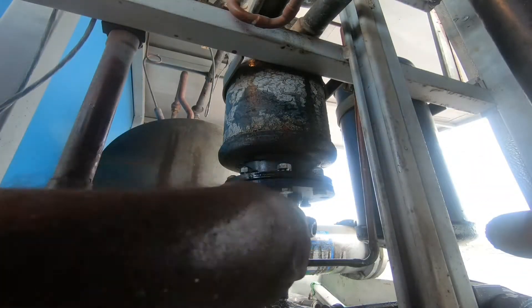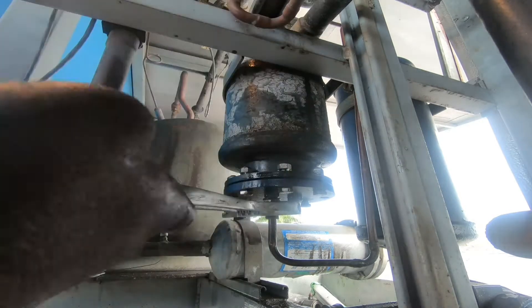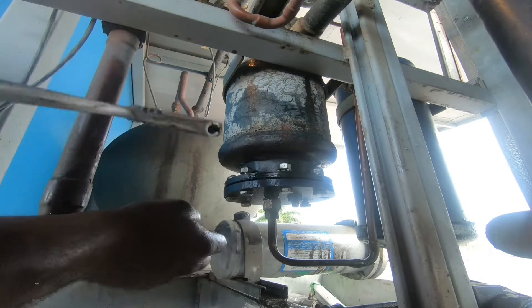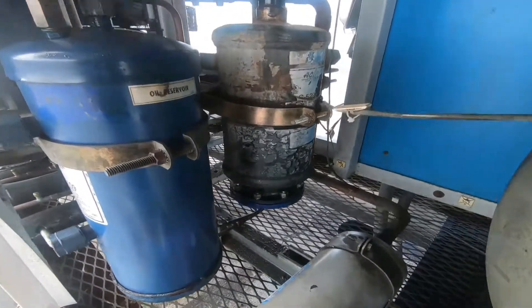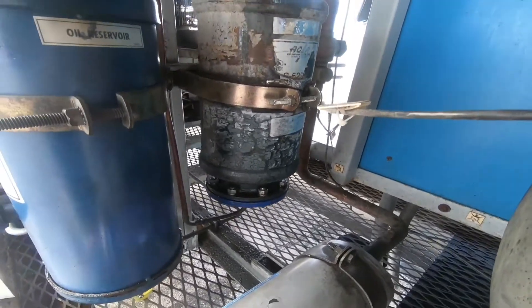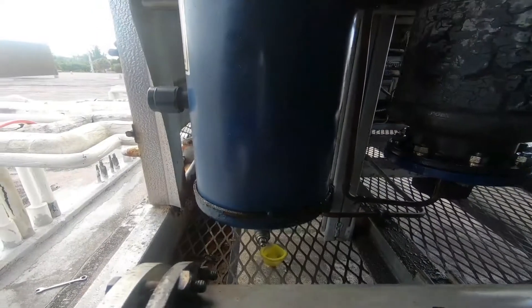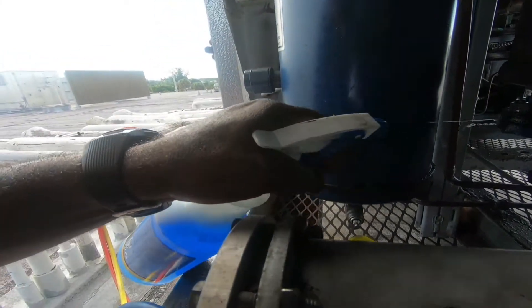I just hooked up this little line right here going to my oil reservoir - it's a flare fitting, I don't want to tighten too much and crack the flare. Let's go around the other side and finish tightening. I'm going to go ahead and pull a vacuum and then pressurize it to make sure there's no leaks. I just pulled this down to vacuum and now I'm pressure testing - there's a lot of refrigerant in this rack and I don't want to lose any.